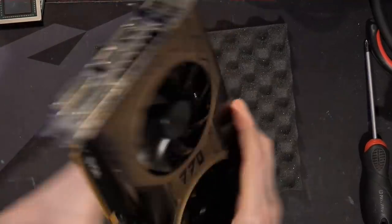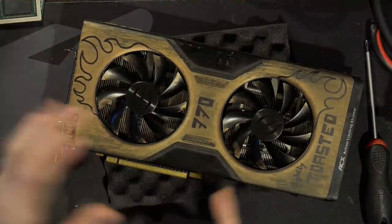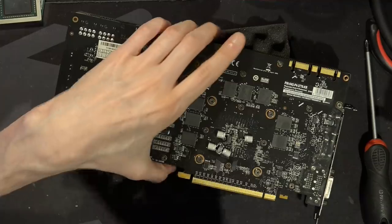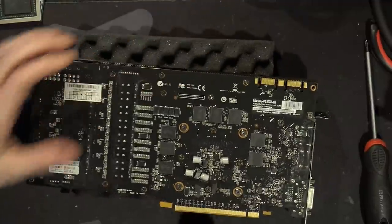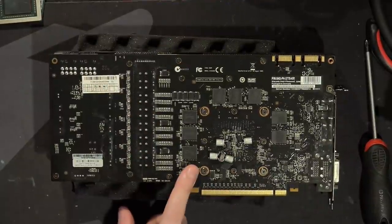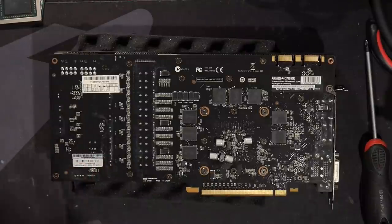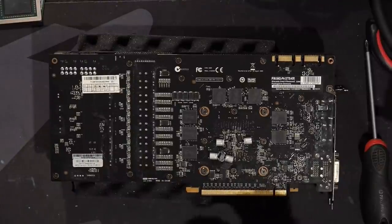Also the color correction on the camera is great — so this turns yellow; it's not actually this yellow in person. Now on the back, you can see I've added some extra capacitors, because the main reason I actually ended up repairing this card is because I have a GTX 770 Lightning that I also repaired, and I did a bunch of oscilloscope testing on that card. I wanted to see how a GTX 770 Lightning's VRM compares to other really high-end GTX 770s, and potentially GTX 680s as well.